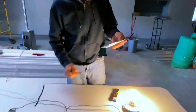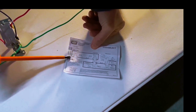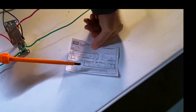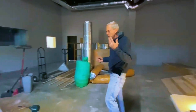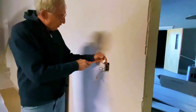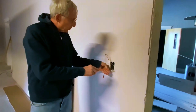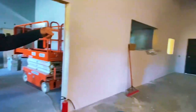Grounds are always important — they're your best friend. Here's a diagram I drew showing the black and red wires so you can understand how this works. To keep things straight while wiring, we taped the wires. These wires here are coming from the front door — that will be the line side of my four-way switch. These wires go to the back door — that's load side coming out, but it'll be line side going in over there. You've got to pay attention to how you pull your wires and understand what is line and load on these switches.